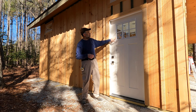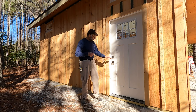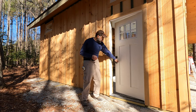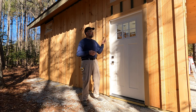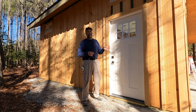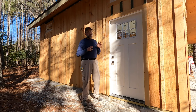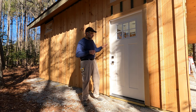Maybe the window details are a little bit less ritzy looking, but still, for a barn at $400, this is a really nice door. It has good insulation value and it's a nice solid door. A lot of times when you hang a door in a pole barn you've got to go crazy with the shims, and that was definitely the case here. You want to keep the door nice and square and have a uniform gap all the way around between the door and the jamb. With a pole barn's big heavy wood posts and rough framing, it took me a little bit longer than usual to hang this door, but it's nice and true and it came out great.